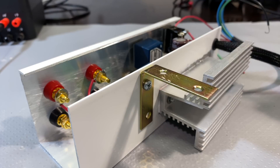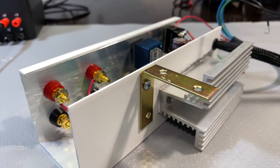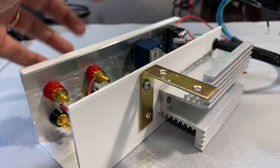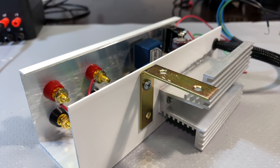One of the reasons why connecting the whole chassis to ground is probably not what I want to do is that the aluminium strip will cause a ground connection to all the other devices on the shelf, and I'm not sure I want that. But I've got the option - I've got that earth wire there. If this thing creates any kind of hum, I might be able to resolve it with the earth wire. I don't think it will - it'll be completely isolated. Ultimately, if I put a scope on there, the scope's grounds will be earthed, so this way I can avoid earth loops.